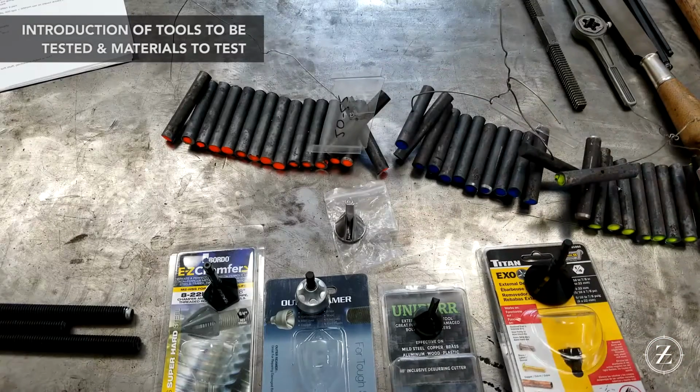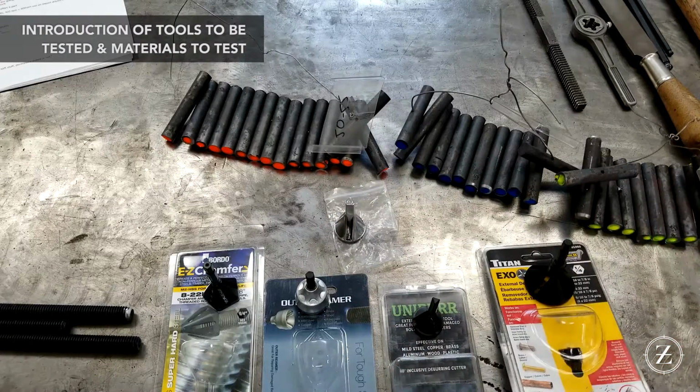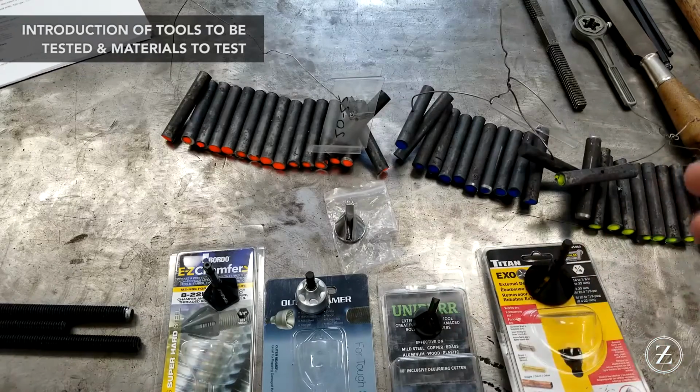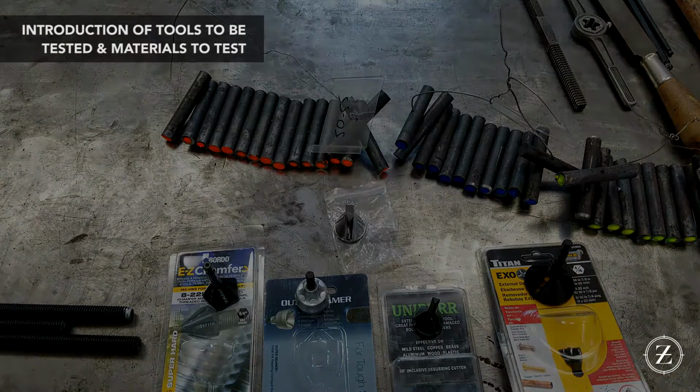This is O1 hardening steel, and we were demoing a hot shot and teaching people how to harden things and temper them back. So we did all the hardening in one giant batch, and then we did 3 separate tempering batches and drew them down to a lower hardness. So let's get some of these and a fixture that Reen had made up and start doing some testing.